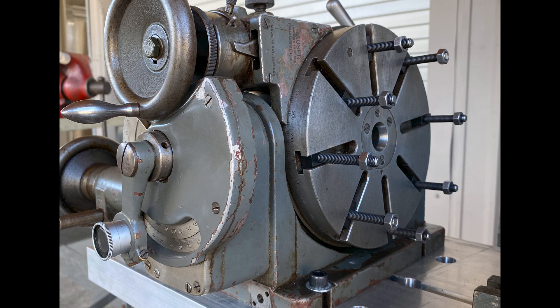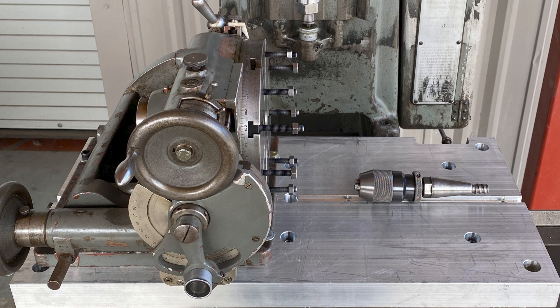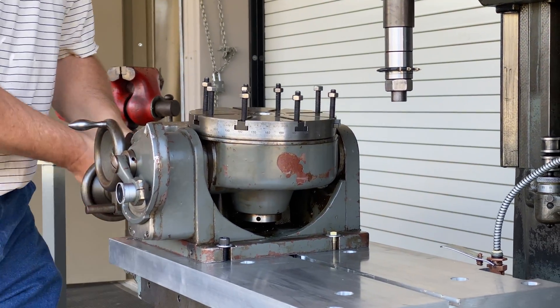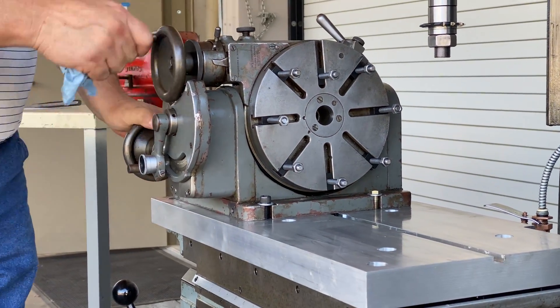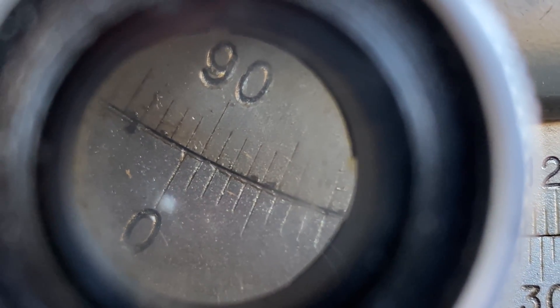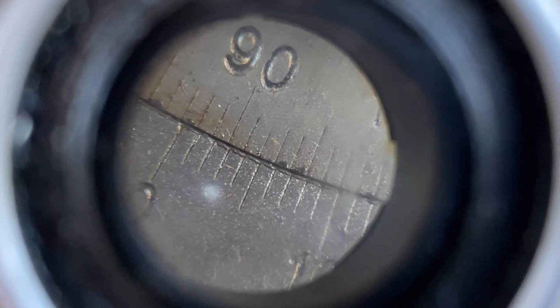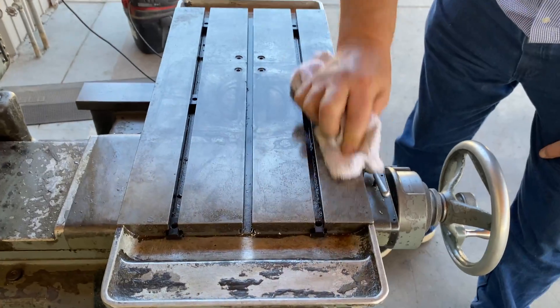Here's the final mock-up of what our rotary table and the Ellis dividing head are going to look like on the machine. The Hauser is a rotary table mounted on another rotary surface so you can tilt it. This is in the horizontal position — the plate's facing horizontal — and it goes vertical, coming back down to horizontal. Very nice piece of Swiss gear. Here we see the arbor that has the gear cutting tool, Ellis dividing head on the right, Hauser on the left.